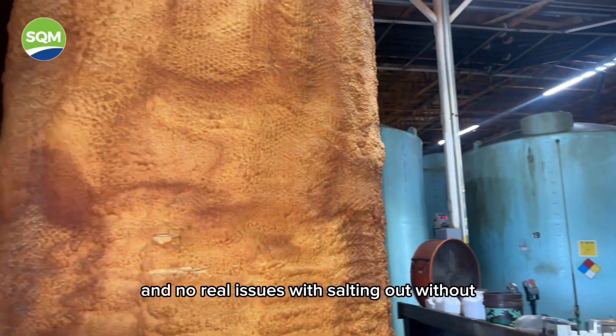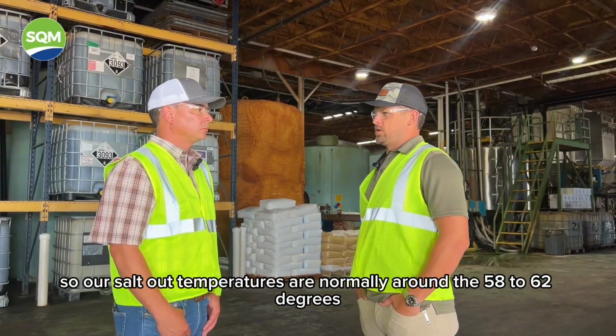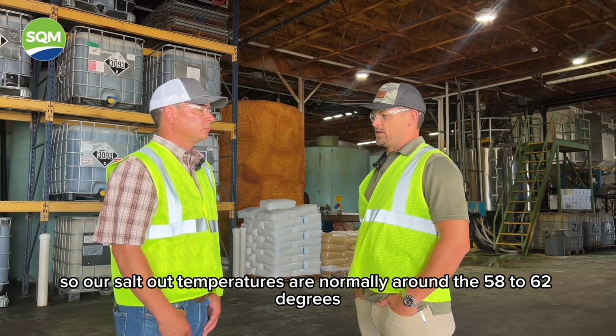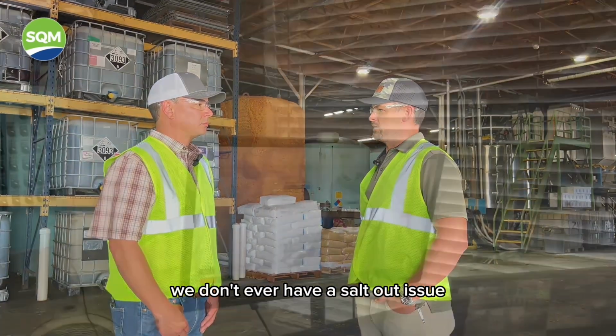And no real issues with salting out with that particular process? No, a lot of our blends are real saturated, so our salt out temperatures are normally around the 58 to 62 degrees, but whenever it's summertime here, we don't ever have a salt out issue.